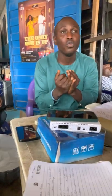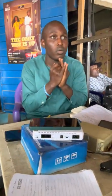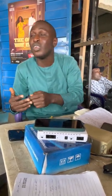And the other one, we just have solid colors. When you have blue, you just have blue, you have brown, and you have two whites. It's left for you to separate which white belongs to the other one. Sometimes you need to test for conductivity to know which white you are using for which. If it's band stripe, you already know that you don't have two whites. One is blue-white, the other is brown-white, or orange-white.